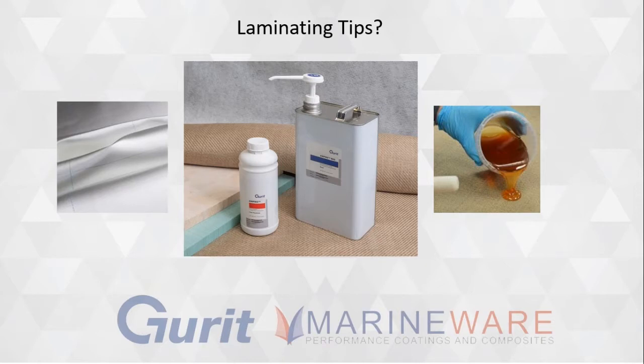I think the fundamental difference is your overcoating window. With the older system you really had to be very careful to hit those either tack-on-tack with your laminate or fillers. With this, given the atmospheric conditions, you can leave it and laminate straight on top of it. It makes a huge difference to your stress levels when you're sheathing something — you can go, stop, have a break, and probably make that job better.